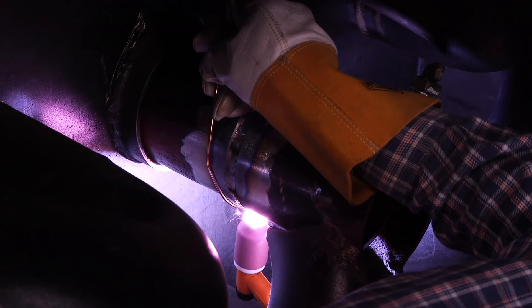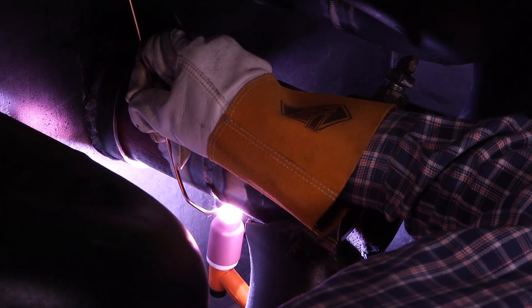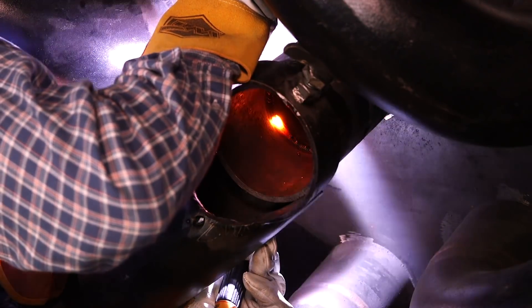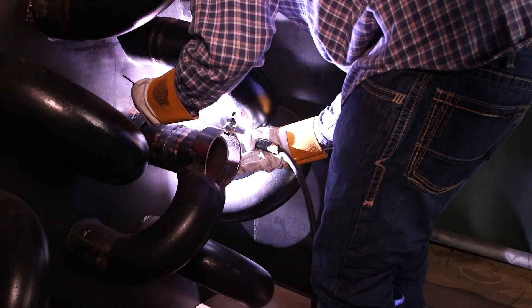On the hot pass, this is a 4-inch schedule 40, so you could almost flush it on the hot pass — a lot of people do. But I don't like to flush it all the way because I want good penetration. Right now I'm running at 130 on the hot pass. I try to go a little bit fast so I don't get suck-back from staying on it too long. Move that wrist back and forward, try to hit both bevels at the same time — never skip a bevel. I try to get each end almost the same, like a little stack on top of each other. Keep it tight, and if you've got to lower the amps on your left-hand side, you can. That way you can hit every spot.